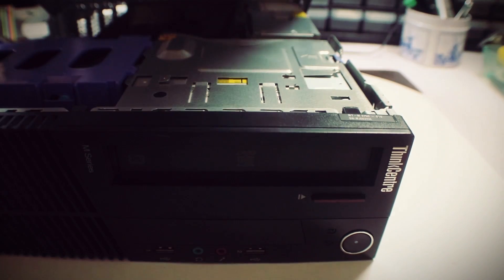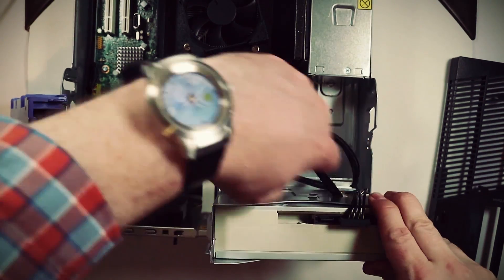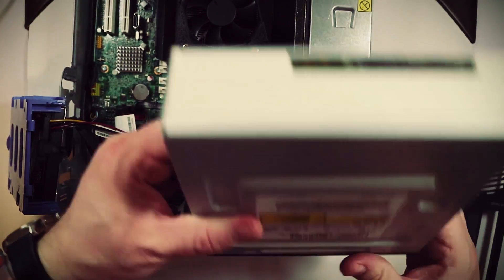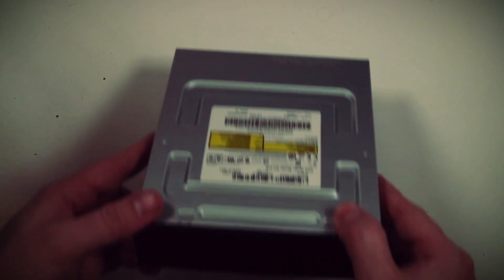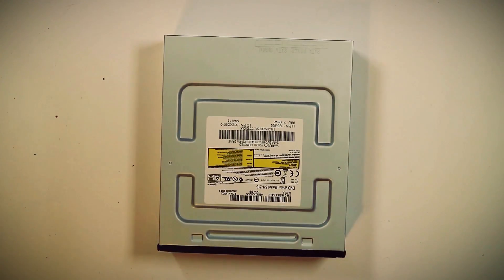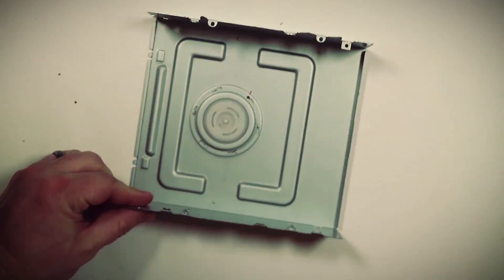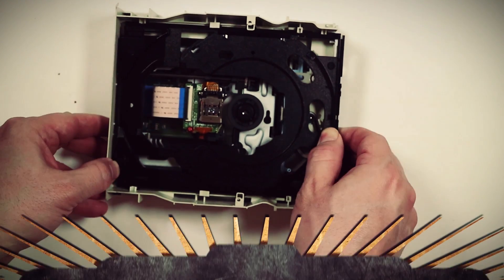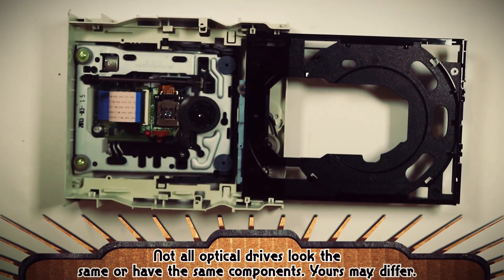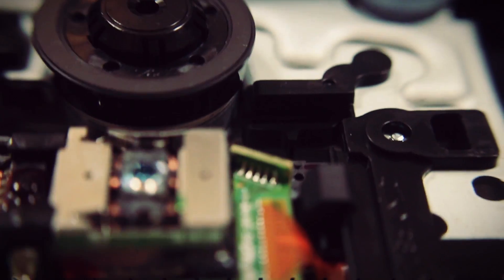So how do we get the motor and sliding rail system out of it? Time for some invasive surgery. If the drive is in a computer, the first step is figuring out how to remove it — in most desktops it generally involves removing a few screws. On game consoles or DVD players it may require a little bit more effort. But once you've extracted it, it should look something similar to this. The outer casing may have a couple screws but basically just pops off.